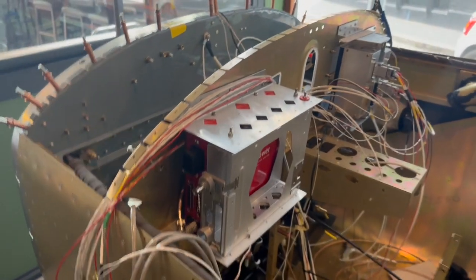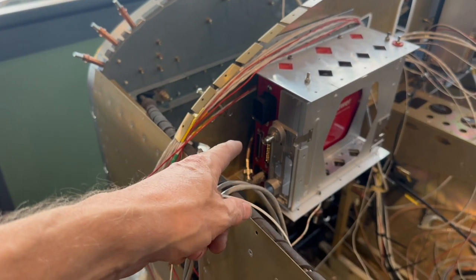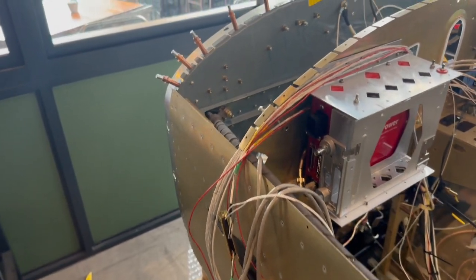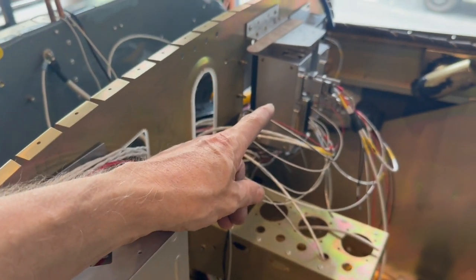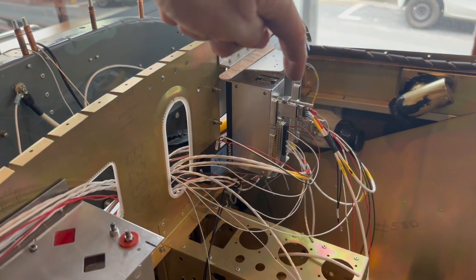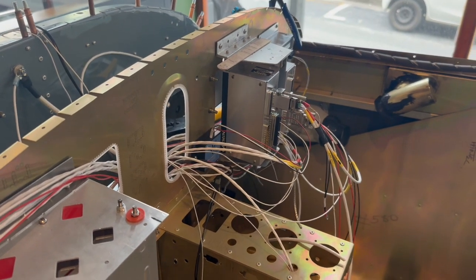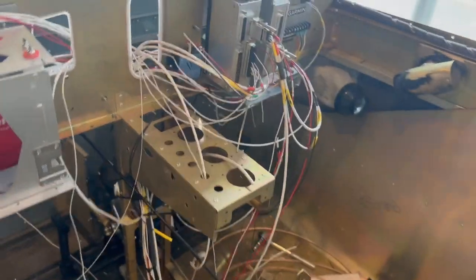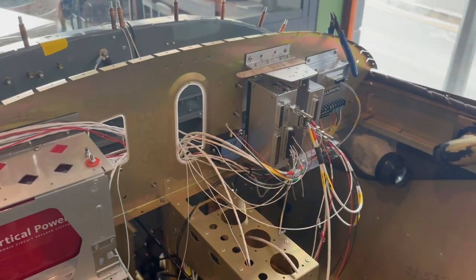Over in the fuselage, I've been doing a little bit more wiring. Still waiting on a connector kit for the VPX. And so consequently there's quite a few wires just sitting there ready to go. Made a really basic start on the GEA, which is this fella here, the engine analyzer, and then that guy there, the GAD29. All I've done is just put the CAN bus connector on there and some power wires to connect into the VPX when we get the connector kit for that. And the GAD27 we got, that's turned up, so I've made a very quiet start on that as well.